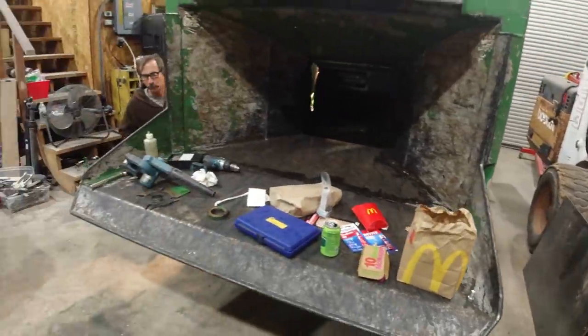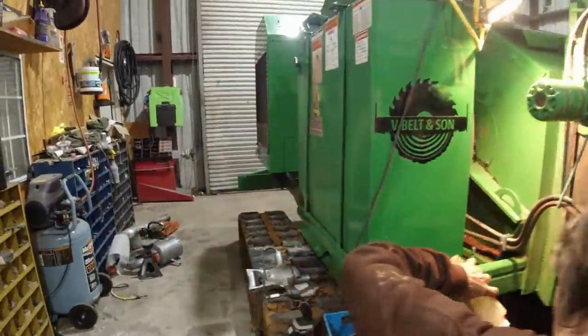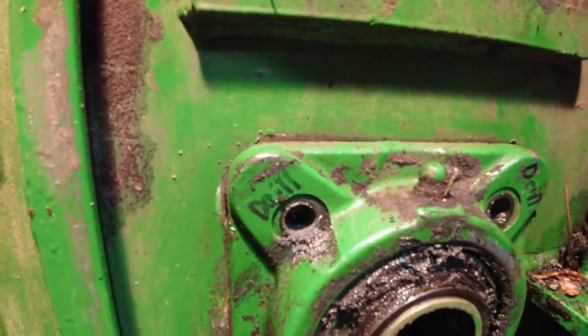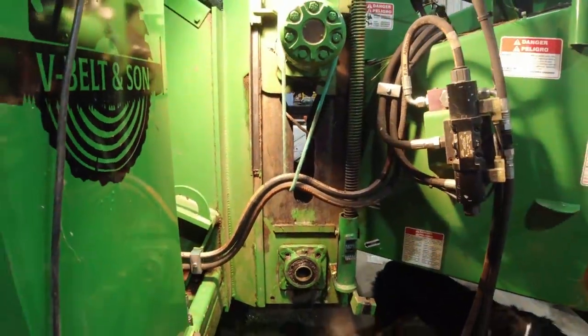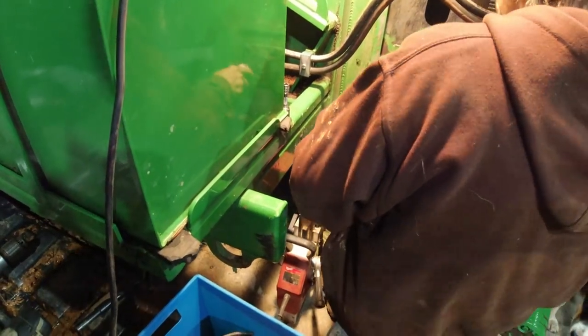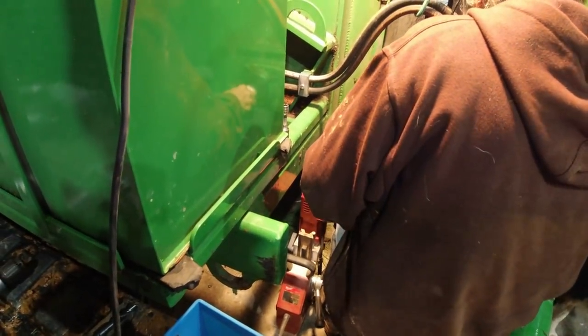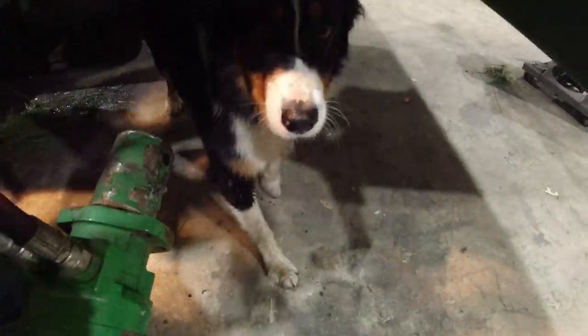So we have to drill through. It's not that big a deal. There's a lot of meat on the bearing. Drill through that, and then we gotta drill and tap the wall on the other side. Brought the Milwaukee magnet rig, but we're going old school. Bunch of bolts.